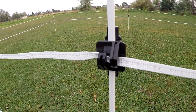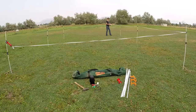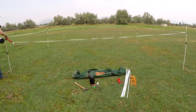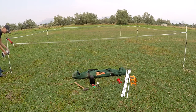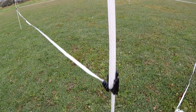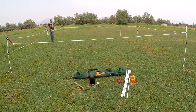You want to make sure the tape fits in the clips flat and correctly. Otherwise, they can slip out and your fence will sag. You can adjust tension as you go, and you want to make sure it stays fairly taut. I found that the second pass is trickier to get even tension on. Depending on how deep you drive your posts or how sturdy they are, they'll start to bend or lean inward slightly. One tip is to set your posts leaning slightly outward, so when you secure the tape, it braces them more straight up and down. Once you get back to the corner gate post, you just move down the post and begin the lower rail, retracing your steps back to each post.